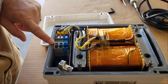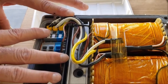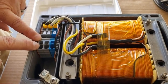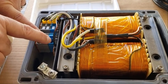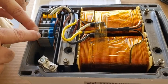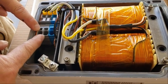You're going to wire up line one and neutral on the input to the transformer from your generator or source. Then to get 220 on the output, you're going to tap off line one — either off the generator, source, or right here — and tap off line two, and you'll have 220. So when I put 110 in here — neutral and hot — I'll have 120. And then right here off these two legs, I'll have 220, and I'll demonstrate that.